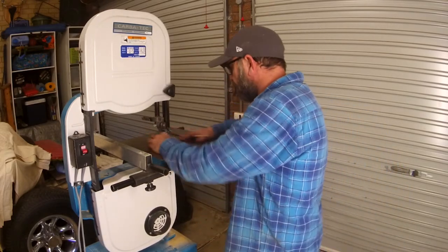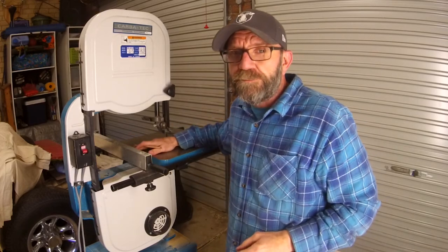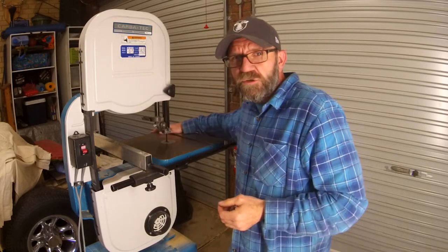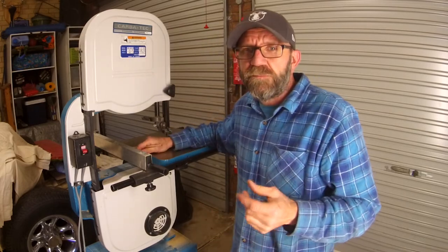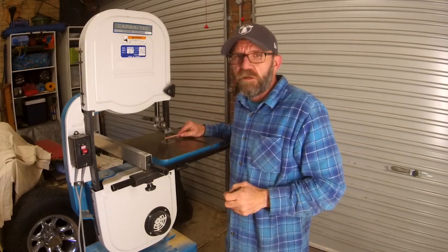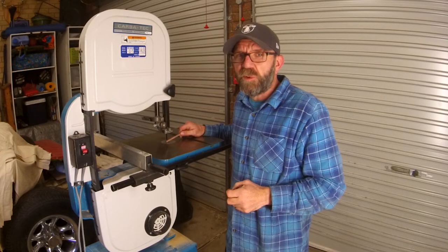The tabletop can get a little bit gunky, in particular if you're cutting up green timbers. So every now and then, give it a good Scotch-Brite and a little bit of WD-40, fixes everything. And lastly, and please don't persist, if your gut's telling you that your blade's a bit blunt, it's time for a new blade. Don't persist.